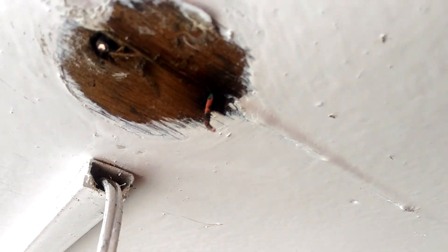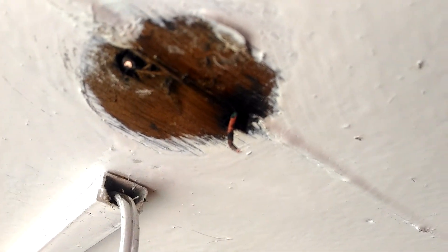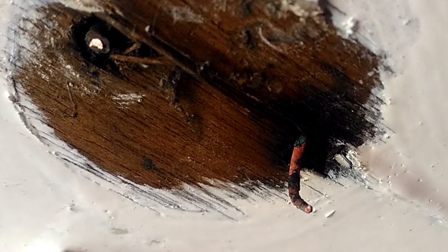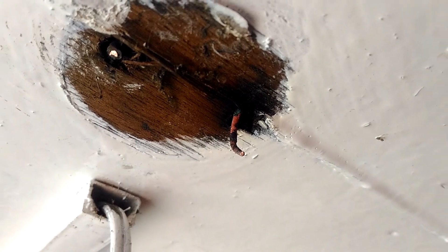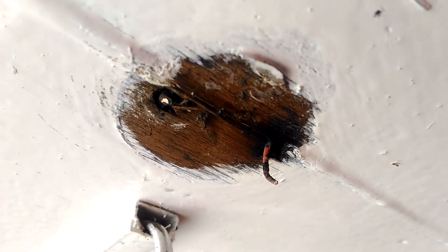It looks like the burning originated from that protruding wire on the right, which looks to have been thinned down by rust. Given the same amount of current flowing through a wire, the wire gets hotter and hotter the thinner it gets. Note that even if the switch is off, there will always be one live wire unless the main fuse box is shut down. The left wire is flushed into the ceiling and it's impossible to grab it unless we tear down the entire ceiling. Luckily, our home was designed with a ceiling crawl space where I can push down the wires from above.